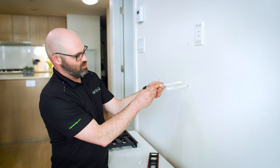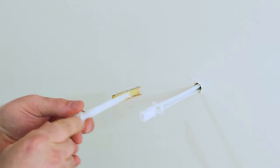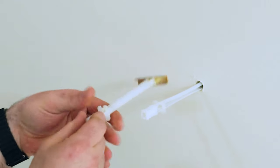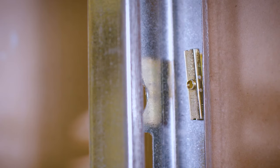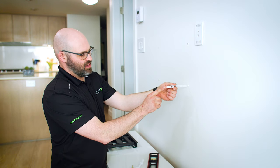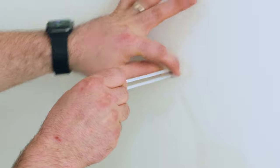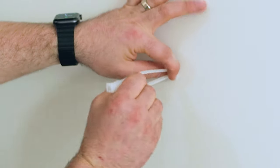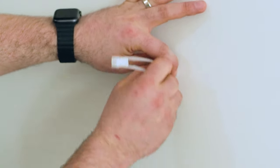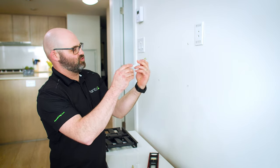When I push that forward, it makes it flush in the back of the wall. When I turn it, it extends. So as I push this in and straighten it, it's going to catch the steel stud behind the wall. Once I've got this lined up and I can see that it's flush, I'm going to push to extend the mounting bracket all the way into the hole so it's nice and tight on the toggle bolt — then just wiggle it to get it nice and tight. Then you just break off the toggle bolts and there's your mounting anchor. I'll go ahead and do this on the other four.